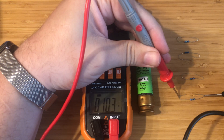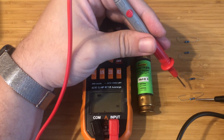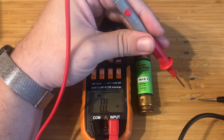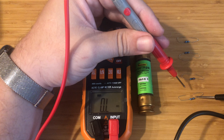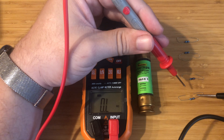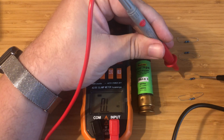This one's coming up with about 10.3 ohms. You can't really see the colors here, but every resistor that's like this style and not a surface mount — the surface mounts are the really tiny ones — those do not have color bands, but you can look up color bands if that's something you're looking for. Maybe I'll do a video on that as well. For the surface mounts, they just have a number on it. So this first one was 10.3 ohms.